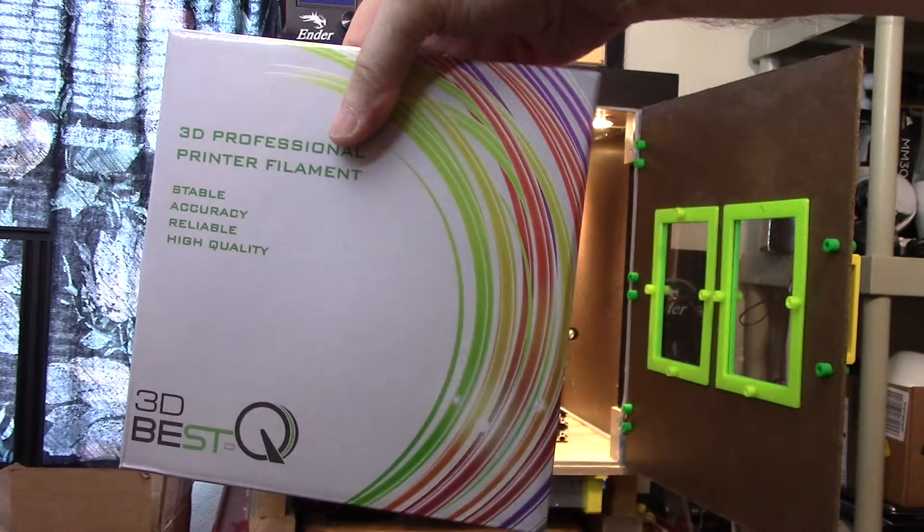Let's look at the transparency of this white filament. This is two layers on sides and top — the sides are one millimeter thick and the top is 0.64mm. Shining a bright flashlight on it, it's pretty translucent. It's also transparent to a small two-millimeter red LED. So I'm going to do two more things in this video: first I'll try printing the taillight lens since the filament is already in that printer, and after that I'll try the ASA on a non-enclosed printer to see what kind of warpage I get.